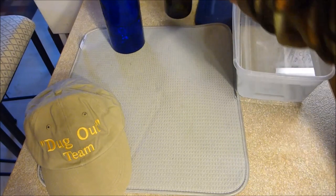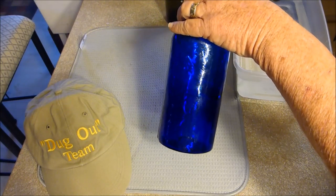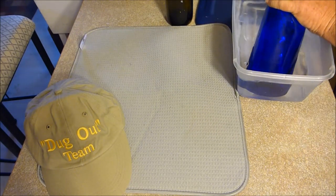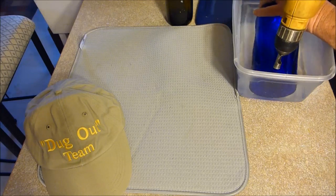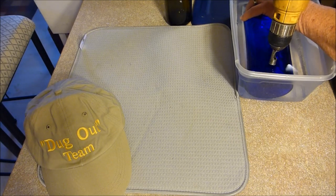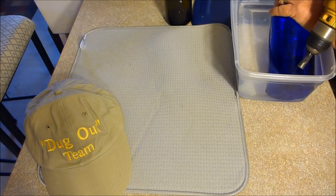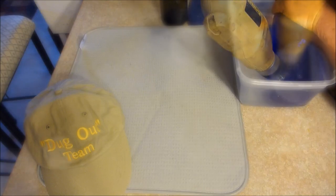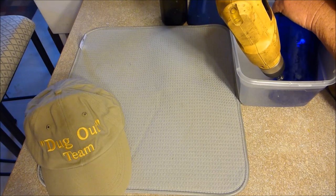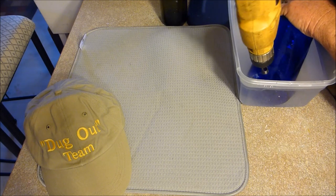The other thing you need when you drill bottles is water. You want the bottle down in the water so the bit is turning in water. Start the drill at a little bit of an angle to get it to bite into the bottle. When it starts to go through, you really want to slow down and not smack the bottle with the drill.